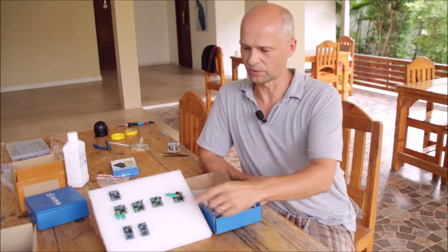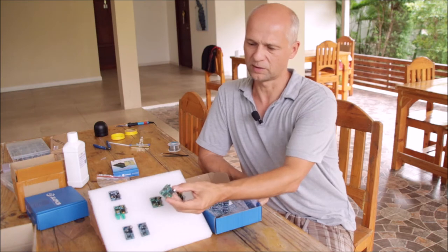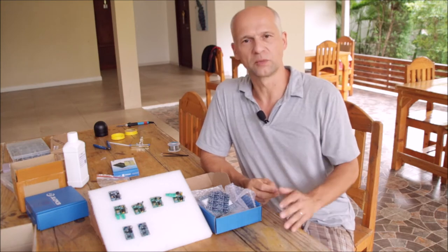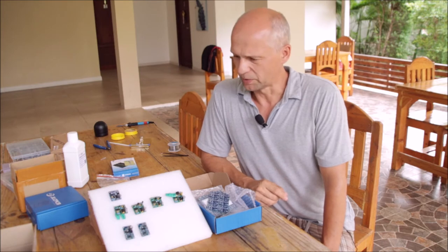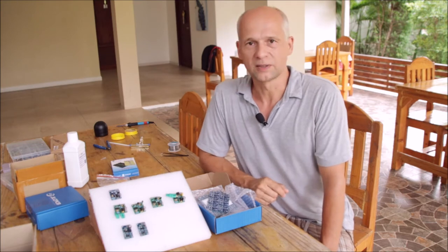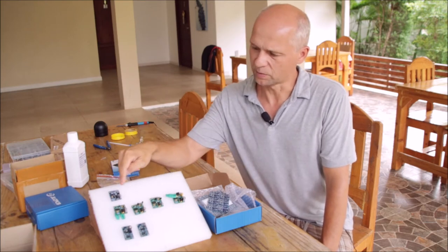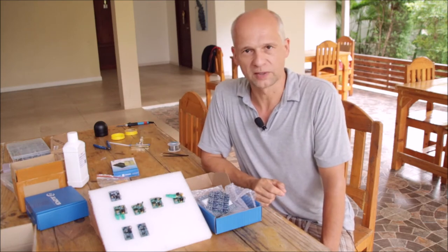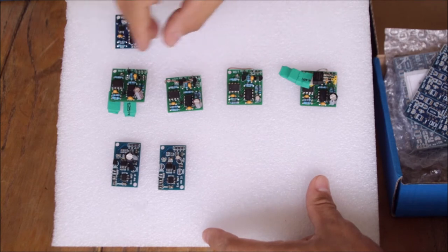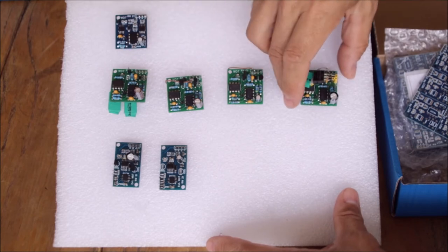The reason it did not work was the small signal MOSFETs — the 2N7000. Those MOSFETs internally just burned up by applying just one second of heat during soldering. Once I knew the problem, I designed a final hybrid board: the timing circuit is through-hole so it can be changed easily, and the switching circuit uses two double MOSFET ICs.